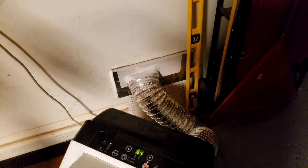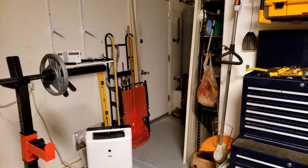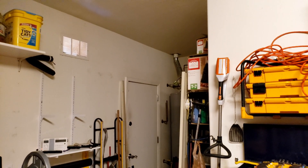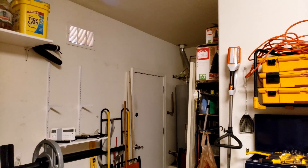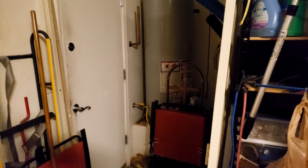This isn't a perfect setup. I got another vent up here that I couldn't close because I have the hot water heater over here and it needs to have a vent by it. One of the things I want to do is frame in this part of the garage and have that be a hot water closet, but I'll need to put some vents in the wall because you have to have vents near your gas hot water heater. So in the meantime I have a little bit of heat coming in, so it's not perfectly self-contained.